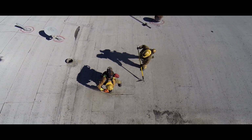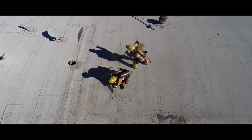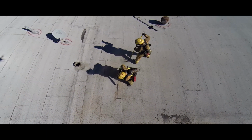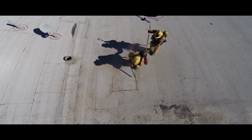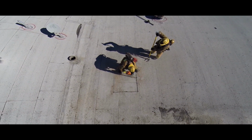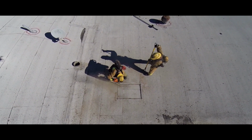Notice the foot alignment is in line with the rafters. This increases your chances of standing on a sound member and aligning your proper cut. A center rafter louver will work for almost all styles of conventional construction. Start small with a single panel and expand it if needed.